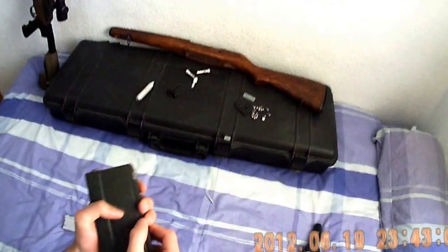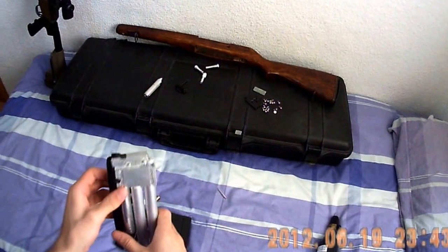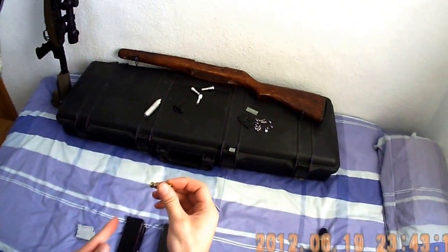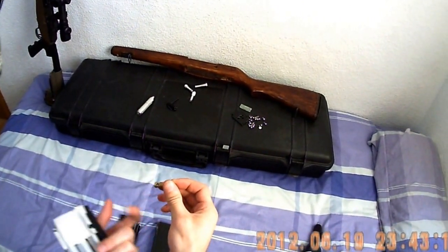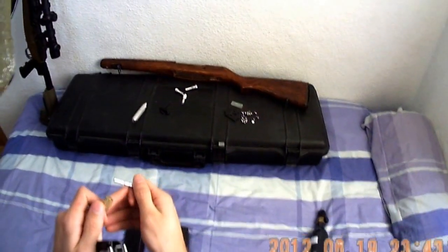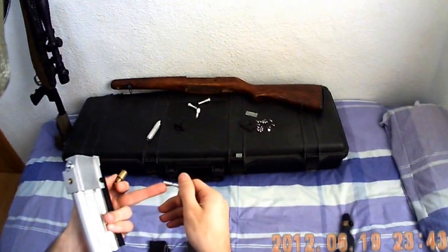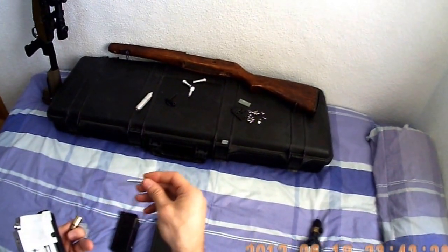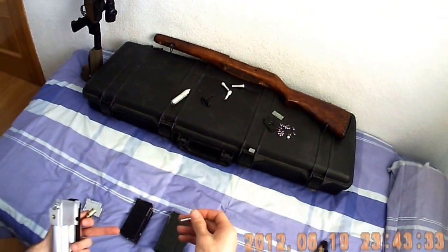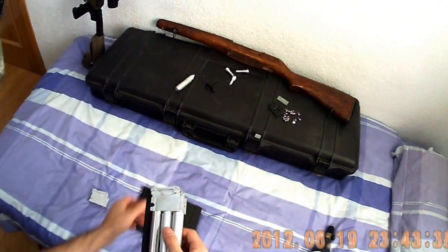So I made a second prototype, and this one works like the GHK design. In the GHK, the gas comes in the middle and tries to escape from both sides. Since the area in the front is a bit smaller than in the back, the force is smaller in the front and pushes to the back with approximately one kilogram — so it's pretty easy to open.